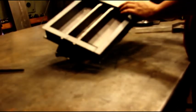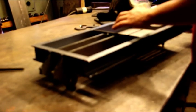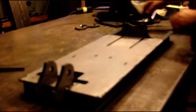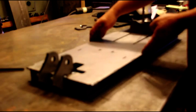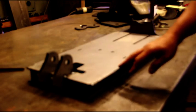We've got everything tacked up together — we've got our bottom brace in and the front brace with just a few tacks on that right now. When you're putting it together, make sure you get everything in there nice and square and check it as you go. Make sure your pieces back here are square — when everything fits flush to the edges your tabs come up through right there. We're going to put a few welds along the edge on each side.